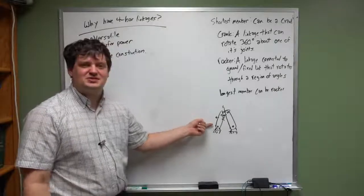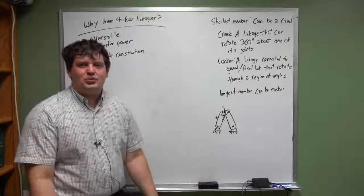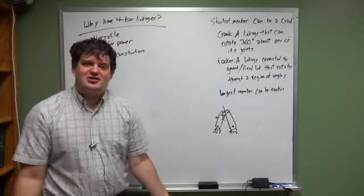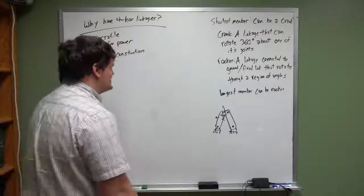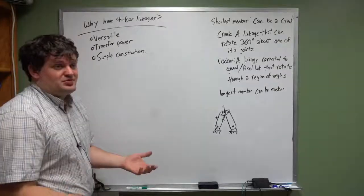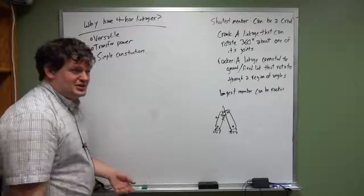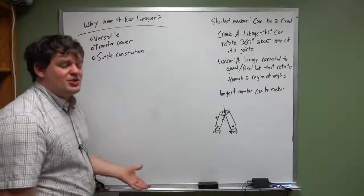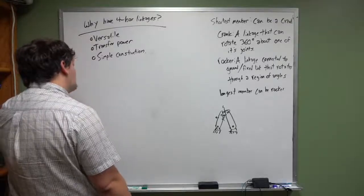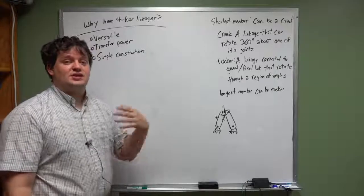This is just plain steel. You could take a popsicle stick with a couple of bolts in them, and you can create a four-bar linkage like this. It's really not hard. So that's the beauty of a four-bar linkage. It can be made out of anything. It's just flat stuff with bolts in them, or tubes, or pencils, anything that comprises a revolute joint. So when we go to build them, they have a lot of properties that are really nice for us as a designer.